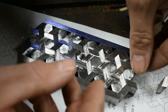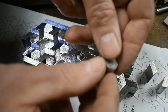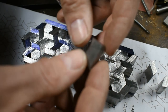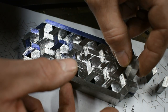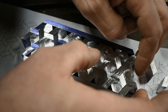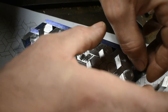Also, the cores are machined hexagonal stock made out of 1080 alloy high carbon steel. When I'm done etching the alloy, the cores will etch to be a black color, and all of the weave elements will have the illusion of weaving over and under because of how I've arranged the pattern and these bars, but I'll show all that stuff to you later.